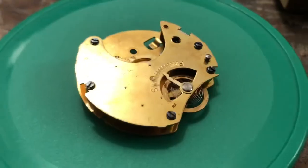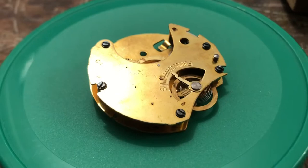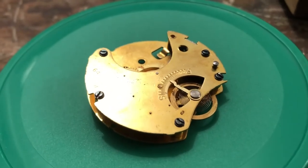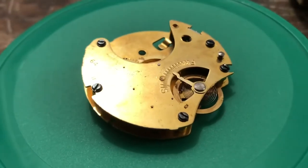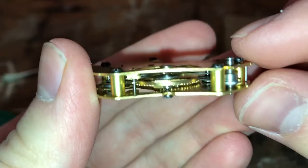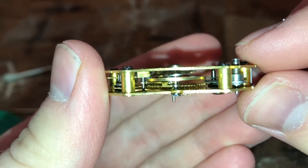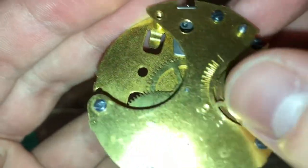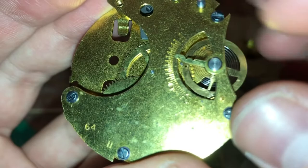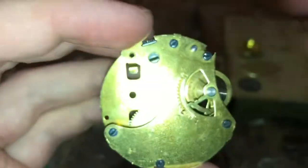I might have to skip this part too. Okay viewers, to say the least, that was weird. I'm not sure who pinned this hairspring or what, but I think they did it flat out wrong originally. The best I could get this thing to look like is like this — otherwise it would just bind up in the regulator. And of course when that happens, the whole thing is being bent out of shape, so that's great.